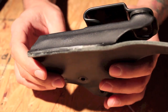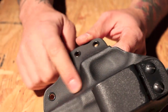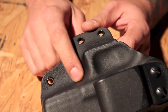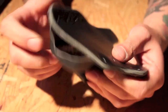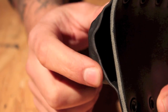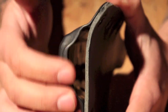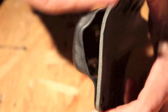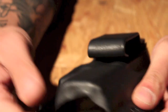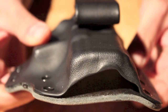Next, the definition of the mold is pretty good. You've got a couple spots where I can tell you overheated with the heat gun or some other such thing — just be more careful with your heat gun. The muzzle end has an interesting little wavy thing going on. If you want to get a really clean edge on the muzzle termination, especially when you're doing something like this where it folds down the entire way, just put a little spacer at the end of the muzzle to square it off. When you cut it, you get a square cut, not a funny wavy cut. You can also crop it closer than the muzzle on that, and you can run a 17 in this too, which I think could be a good thing.